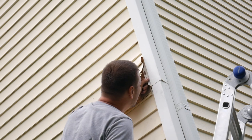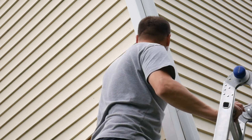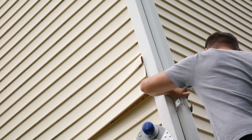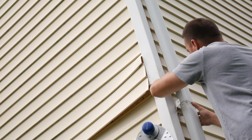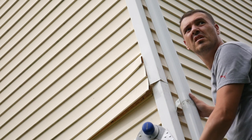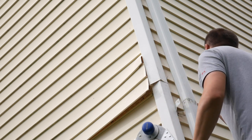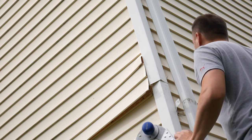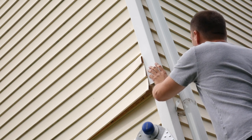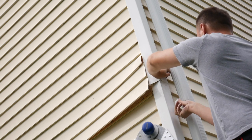You have to prepare everything correctly. Walk around your house and look at the angles, because these cameras only cover up to about 65 or 70 degrees — so it's not very wide. You'll be surprised that once you put it up there you can't see much really. I thought eight cameras was overkill, but that was just enough — maybe I could have used a couple more to cover all the areas I wanted to see. So you have to walk around the house and determine where you want the cameras and which areas are the priority to you to be watched over.